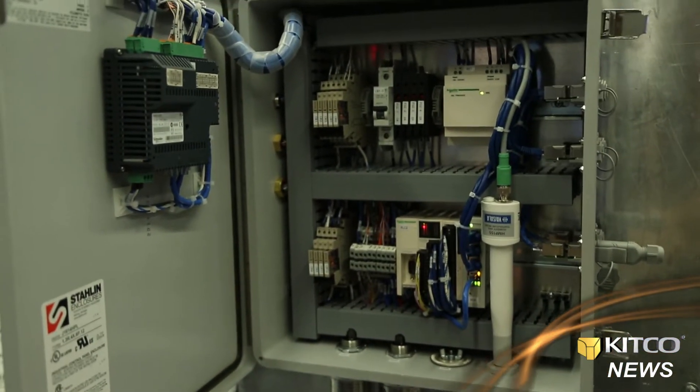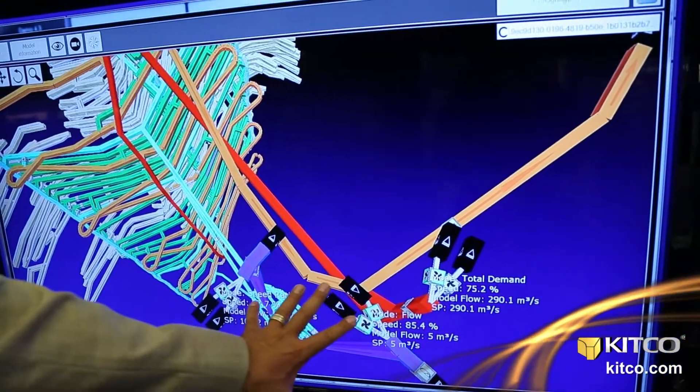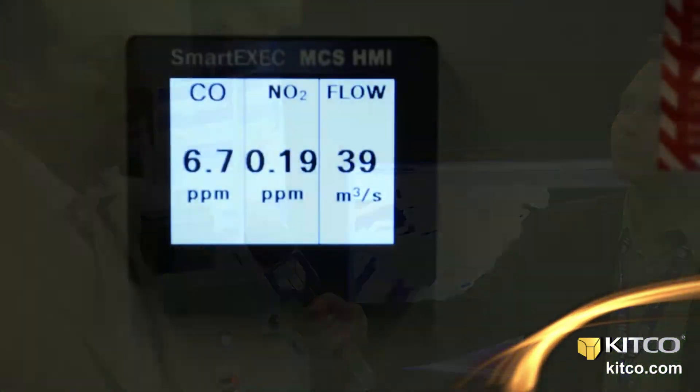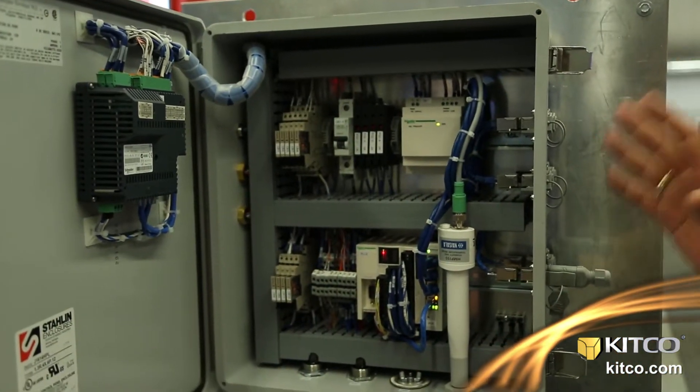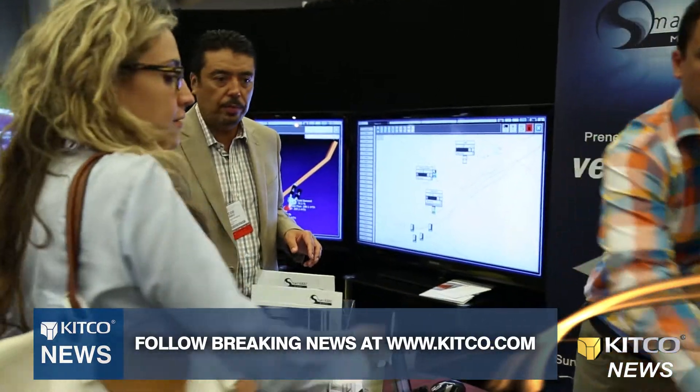So tell me, what is this? We do monitor, control, and optimization of ventilation for underground mines. The objective is to have the right amount of air when you need it, where you need it, at the lowest energy cost possible. You can control this from your office — you don't have to be in the mine. We can connect various different equipment to the mine, whether it's fans, regulators, dampers, VFDs, smart starters, or instrumentation, and control and monitor all of it from a distance. Now that metals are going down in price, miners are looking for ways to save money. This is a way to promote those savings — you could save a lot of money by not transporting unnecessary air into the mine.